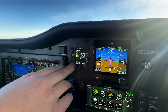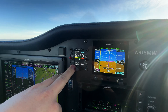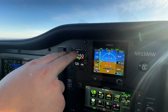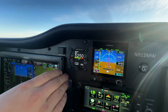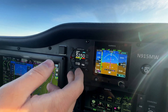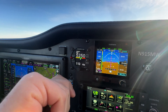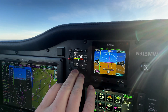An example of using this is if you're climbing at VY, but you still want the full 5800 RPM — like if you're avoiding an obstacle — you can get it right up to 5800 RPM target at your current airspeed. It'll stay in constant speed mode, and then when you start to level off, it'll revert back to advanced mode. There is a knob down here that does, in this mode anyway, the same thing as the switch. I can spin it and select my RPM, so if I just wanted a quick 5800 RPM I could just turn it over real fast.